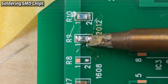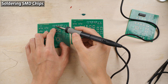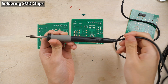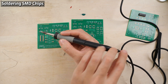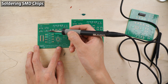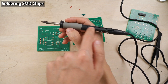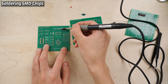Make sure you don't apply too much solder. I've soldered extremely small chip components. The cable connected to the soldering iron is so soft and flexible that I was able to perform very delicate work without being bothered by the cable. If you use a regular soldering iron, I don't think you can perform such extremely delicate work — the accuracy will definitely be lost. This soldering station comes with a thin iron that you can hold like a pencil, which makes soldering even easier.